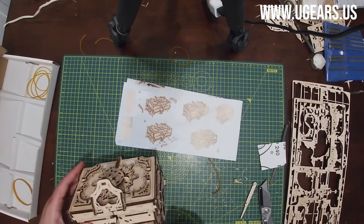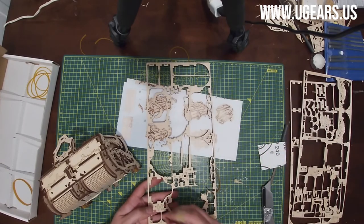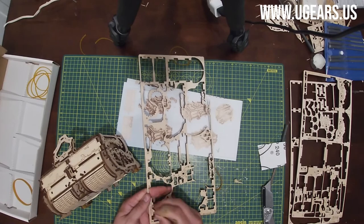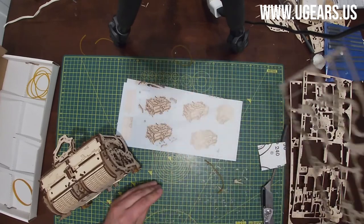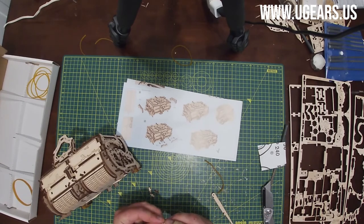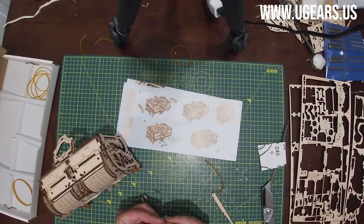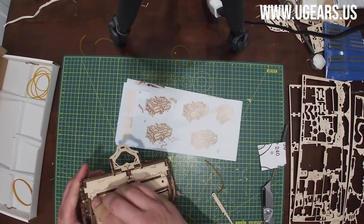And then now 280s, they go into the holes here. Both of those are on board number 3 on the bottom left. So we need 4 of those. There are 4 holes. And let's see, I'll put a little bit of wax on both sides so it's going to be easier to insert those components. Put these parts into the holes at the front.